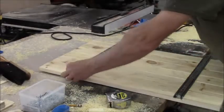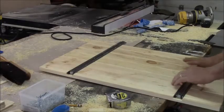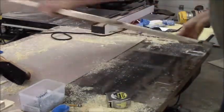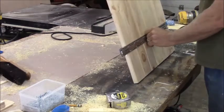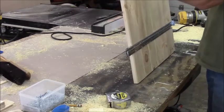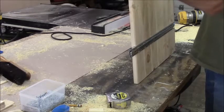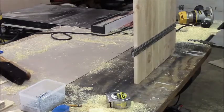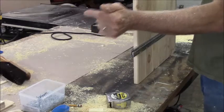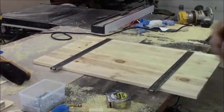My dilemma is I think I need to make the door and put the door in. I left it a little over a sixteenth of an inch high so the door won't drag. That's going to be vertically mounted like this on the end of that one cabinet with the door beside. This goes close to the refrigerator. The cabinet's here so the door will slide back so she can get easier access. I might take this all the way to the wall so it'll come all the way back. I'm going to put a metal tab on the door at the bottom — or just below one of the shelves — so it stops between the face frame and a magnetic catch. But it shouldn't need a catch, really.